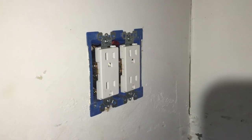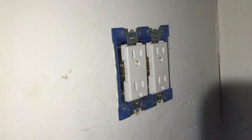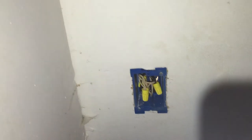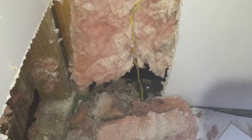I have the upper wall plate in. I moved all the wiring from here up to here, and I have a double plate outlet up here now — that will be helpful when I push my cabinet in. I have the new junction box over here; I just need a cover plate and to seal up that hole with some steel wool. The next step is to go turn the power on and see if the lights come on.